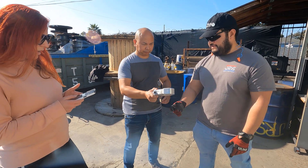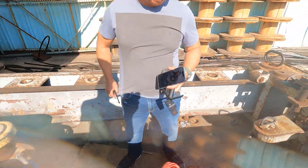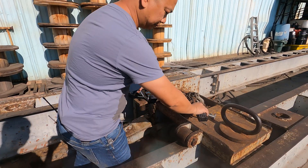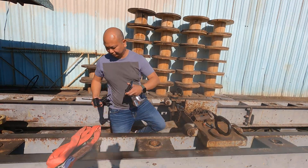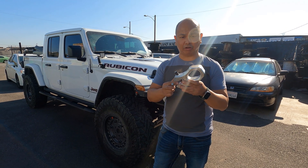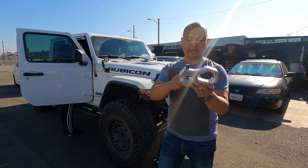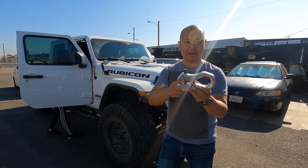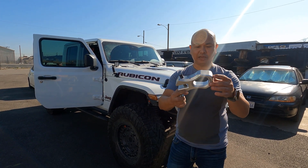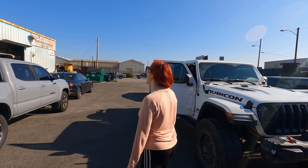We broke their shackles, all their test equipment — but our shackle didn't break. We finished testing. Unfortunately they don't have a shackle strong enough to break ours all the way. We did bend the 17-4 stainless 5/8-inch pin slightly, which is a good sign — it tells the user it's time for a new pin. The shackle broke their test equipment at over 41,000 pounds with no deformation on our shackle. It's a success — we just need a better pin.